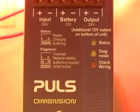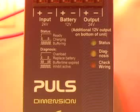The diagnostics of the LED are easy to determine as the indicators are printed right on the front label. The constant current charging method will continue until the battery reaches 85% of its charge, at which point the green status LED changes to a solid green.